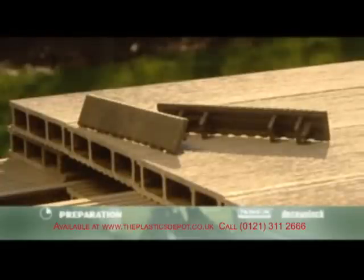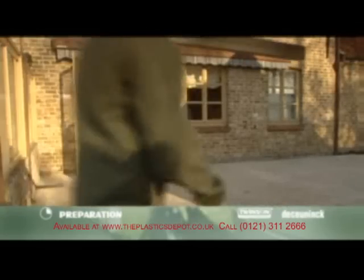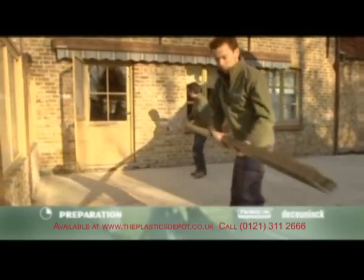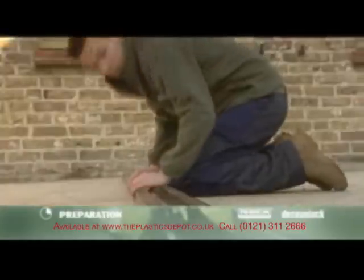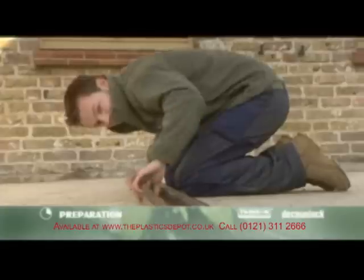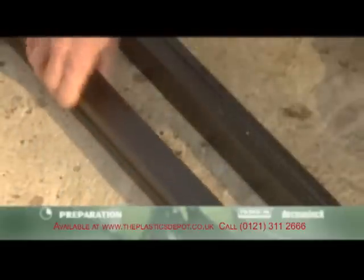As an alternative finishing, you can also use the plinth, which is fixed to the supports with the specially developed Twinsen screws. If you don't use the plinth, use the end caps for finishing the heads of the planks. Twinsen decking planks must be mounted onto a solid substructure. This support frame needs to be fastened to a solid foundation — this can be a concrete slab or any kind of stabilized underground. Never mount the decking planks directly onto the foundation. Water drainage and expansion are very important. Ensure a completely level foundation; leveling of the profiles is not allowed, nor is using leveling blocks.